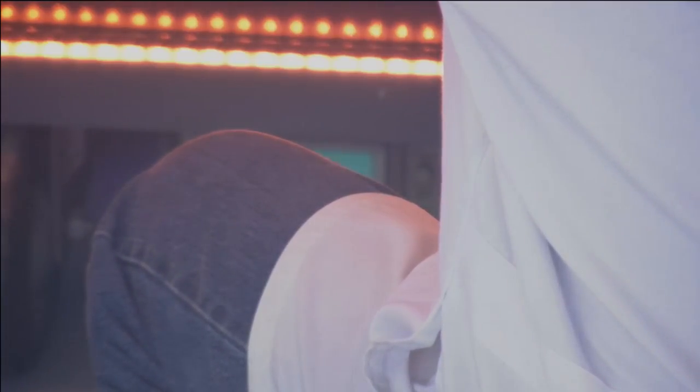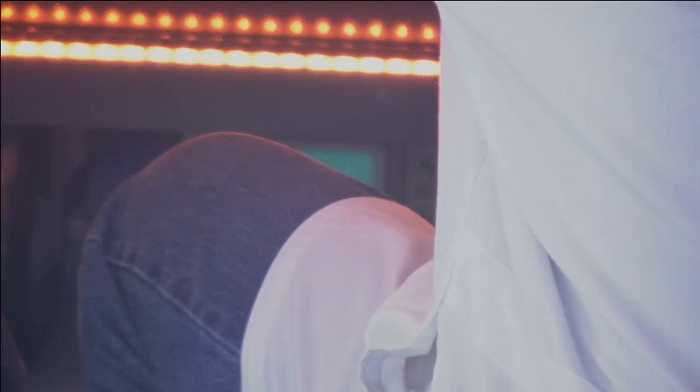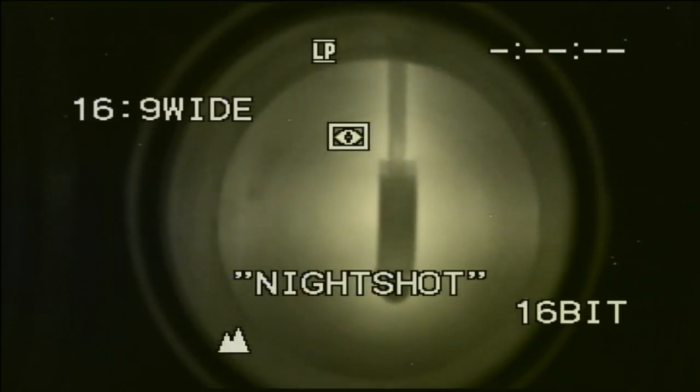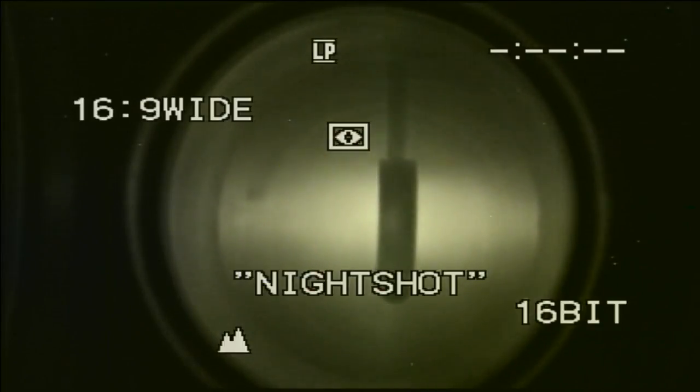Yeah, are you doing that part? I'm going to close our gate valve down a little bit. Do a bit of a plasma cleaning. Pressure is too high right now for the flow we're putting in. So that's chamber contamination. So that's the chamber view right now. So we're putting in a lot of D2, and that's going to ignite a plasma in the entire chamber, and that's going to kind of scrub the walls off.